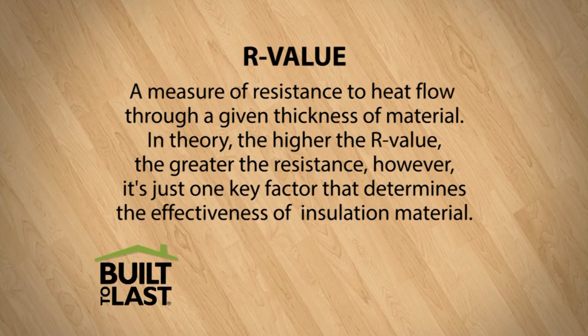Can that also act as an air barrier or a vapor barrier? Some of those can, particularly spray foam insulation, if it's applied at 1.5 inches to 2 inches, can become an air barrier. In addition to the thermal barrier, it can become a vapor barrier. So you start to get products where you might have had to use 2 or 3 products to achieve the overall desired effect, and now it can be done with one product in some cases. So again, very efficient and effective installations. But you should always look at what you're doing. One doesn't necessarily take the place of the other.